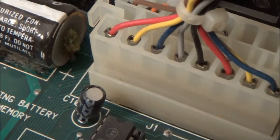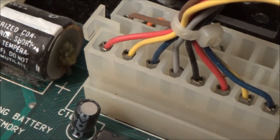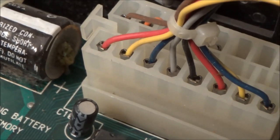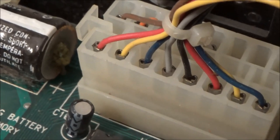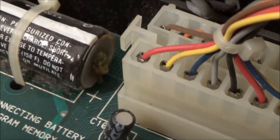I'm noticing that the battery is leaking and corrosion is starting to work its way down the lead of that battery toward the circuit board. Once we get this keyboard up and running, we'll remove the old battery and install my battery eliminator modules so the owner will never need to change the battery again